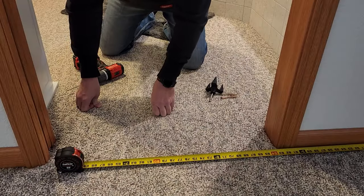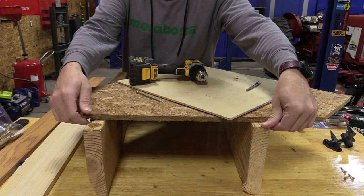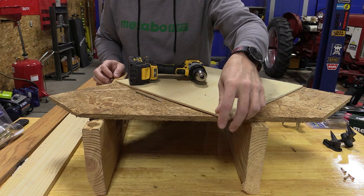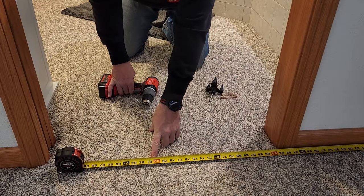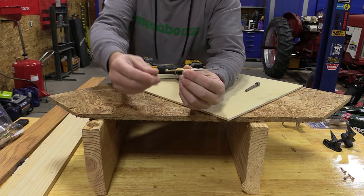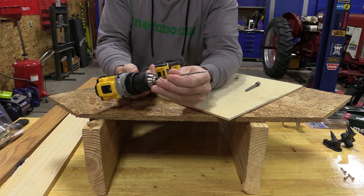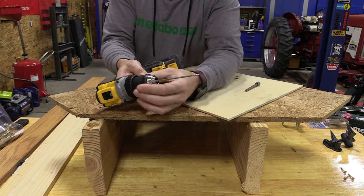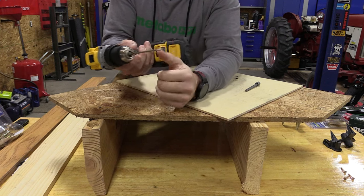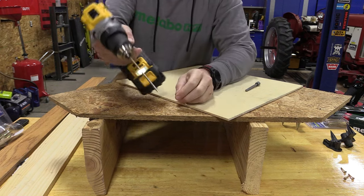In order to fix the squeak in your floor, it could be the joist or the screw causing it, it could be two floorboards moving together, or it could be some linoleum sitting on top and moving around. We need to first find that squeak and find the joist. To do so, we're going to use the tool that comes with this kit. It's basically a long screw, but it's only threaded at the bottom. Put that in your drill — it's pretty short up front, so position it toward the end of the drill so it centers itself nicely. Make sure when you turn it on it's not wobbling or at a weird angle.